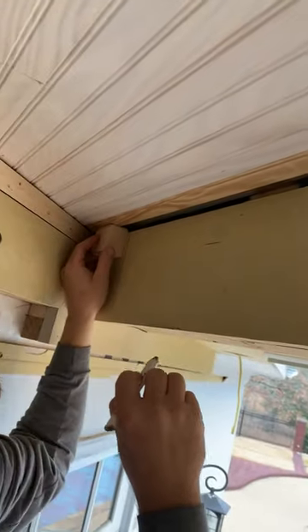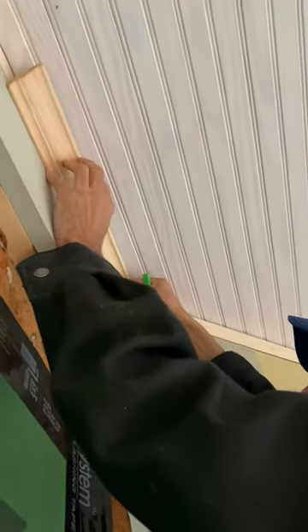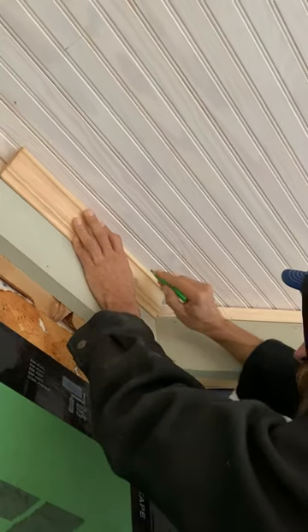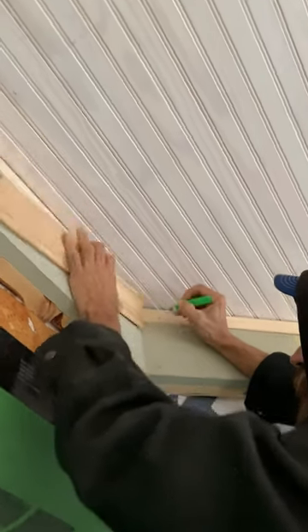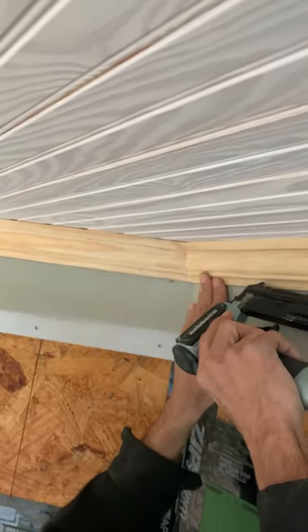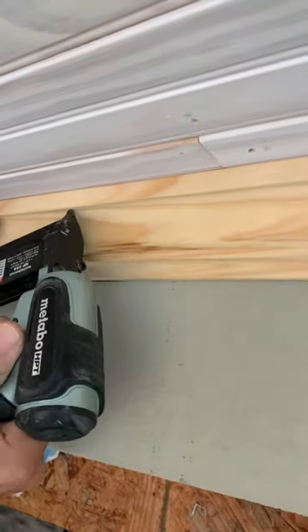I have a small block — I just use it as a reference line for the bottom of where my crown mold needs to go. Then you can fine tune the corners up or down if you need to. I just use some pin nails to fasten this smaller crown; I like pin nails versus a larger finish nail, especially on the smaller stuff. And if you have to find an angle on a piece of crown, I'll mark both sides and that'll find you a point to measure from, giving you something to start with so you can fine tune from there.